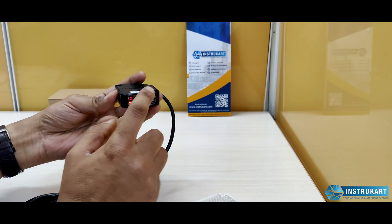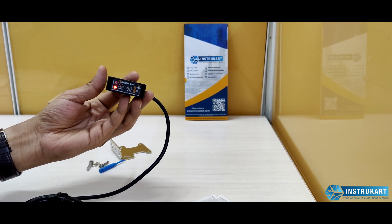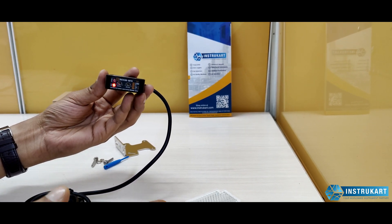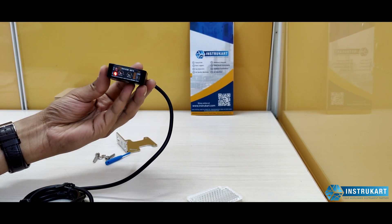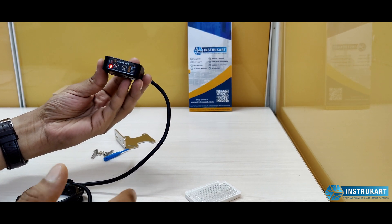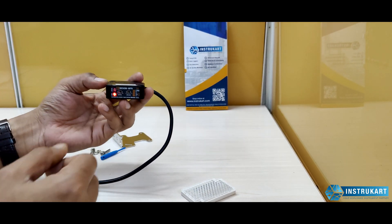The principle of this photoelectric sensor is to convert the light signal into an electrical signal. These photoelectric sensors come in different types used for different applications. The types include through beam sensor, retro-reflective, and diffuse. Based on the application, the sensitivity and accuracy required, we choose the appropriate type.